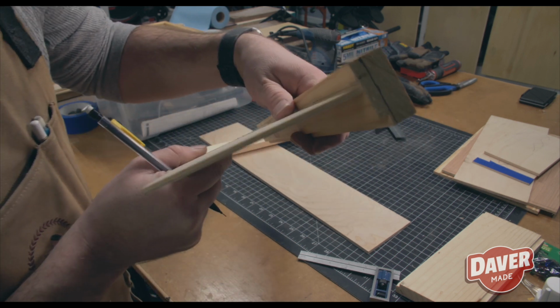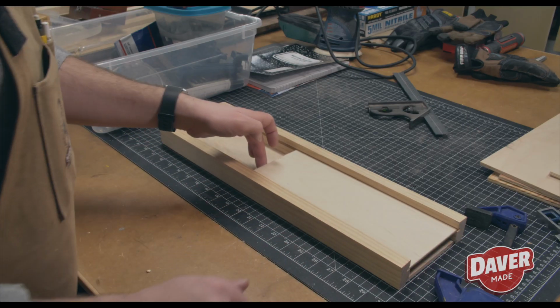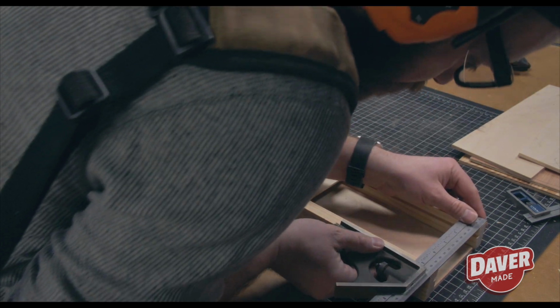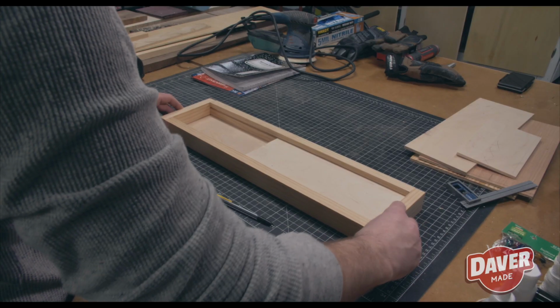Now the front panel is 1/8 of an inch thick, so I routed a groove about that width, but had to make a couple passes to widen it so it would move freely. Then I dry fit everything together and measured the ends so I could cut the end pieces that would hold everything together.